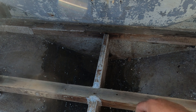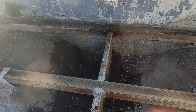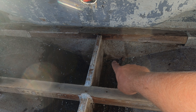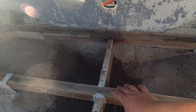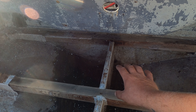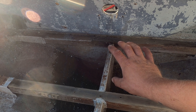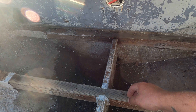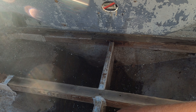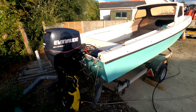The rest of these stringers are absolutely solid - not rotten, just a bit stained from water over time. At the back you can see the bung hole, but only about three quarters of it is showing - the other quarter is partly covered by this piece of wood. I want to fit a decent-sized sump in here. I don't know if you've heard of Gary Bull or Gary Wilson - Flyer, I think they call him - basically the stringer design and sump design I'm going for is similar to what he does. The sump will have three sides with the transom forming the back end, and there'll be another bung on the vertical piece so the deck's sealed.